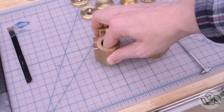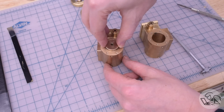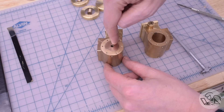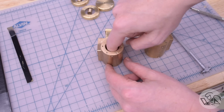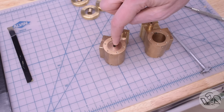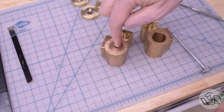It hangs up a little bit at the ends because there's some small burrs on those steam ports that I'll clean up, but if it falls through without getting stuck under its own weight, then you've got a one to two thou clearance. This same test also works on fire tubes in boilers for silver solder clearance. Also, that's just super fun, so I'm going to do this for a while.